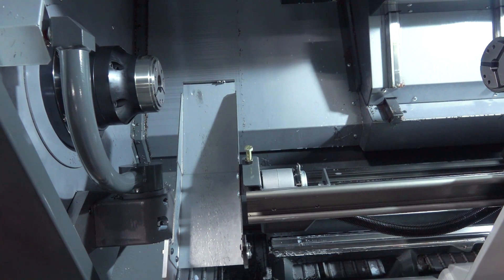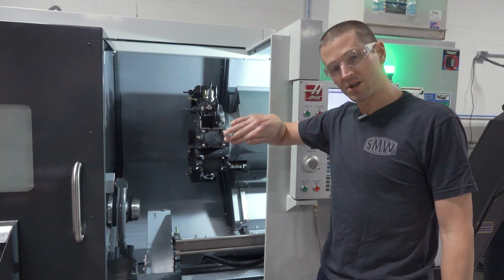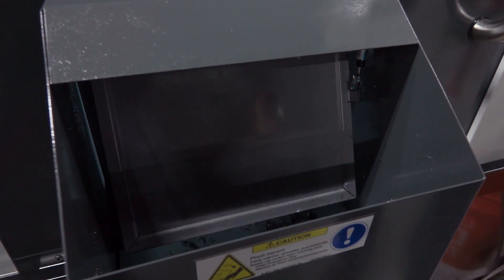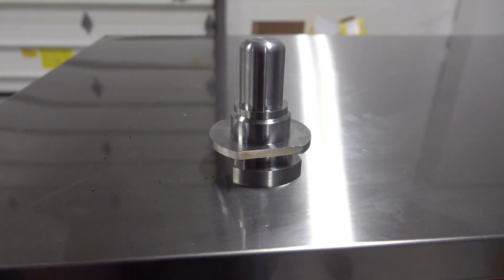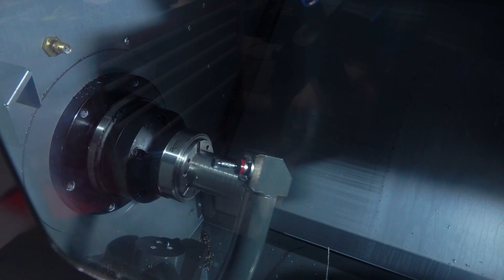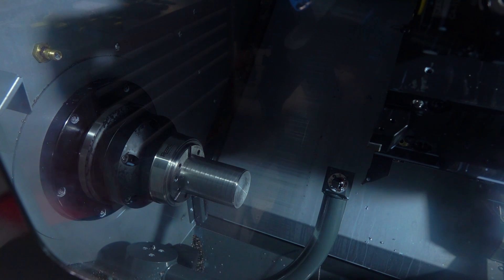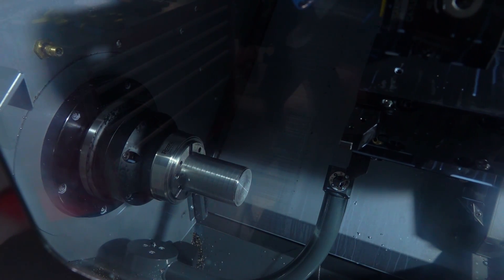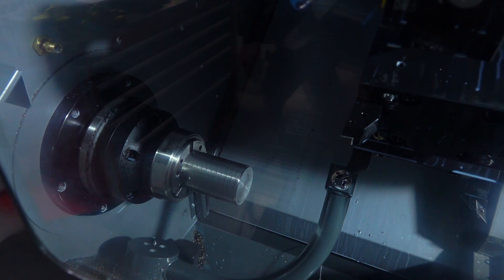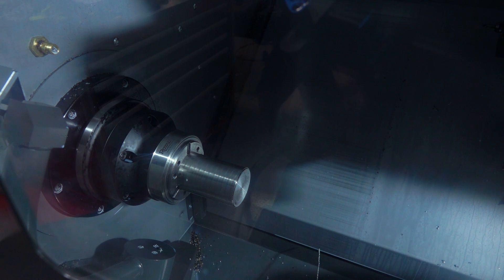Fusion 360 even has a toggle button that lets you toggle whether or not you activate the parts catcher on a parting operation. The only modification we have to make is we've got a couple of pieces of plastic in the front — when the parts catcher pivots out, that's what opens the door. The default black ones from Haas didn't open the door wide enough for some larger diameter parts, so we just fired up the 3D printer. Last but not least, the tool probe arm. Many, if not most, turning centers these days will have these. Some are only manual, some are external to the machine and sit in a box.